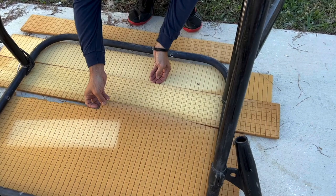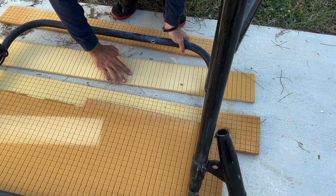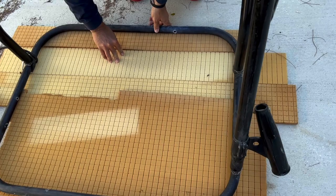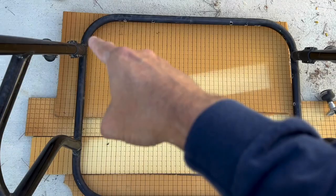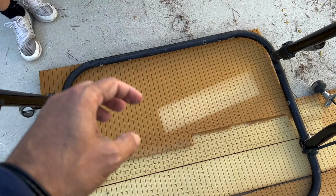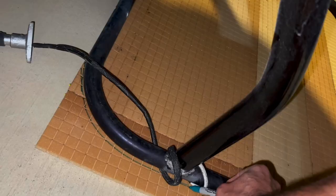Slide it under. Yep, slide that under, just make sure I have enough. And then this guy here, and then this guy here. This is gonna be exactly what we need right here in order to build this. So this is covered. And then once we have all these spliced together, nice and neat, then we'll cut out the edge of the poling platform, and then we'll have our foam. This foam is specific for fiberglass work because the resin dips down into the pores of this foam. So this is very important.